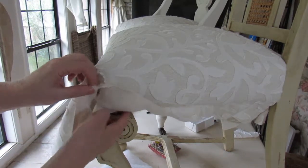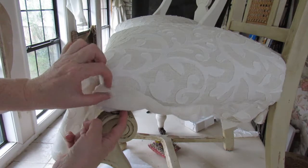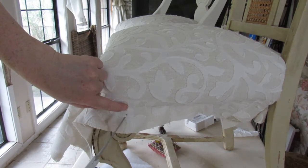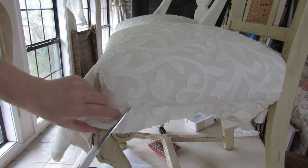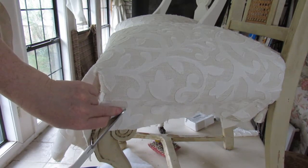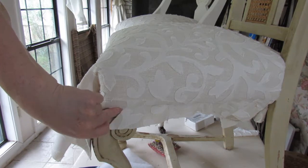Right, I'm going to be cutting here, so wherever the chair leg is, whether it's a square one or a round one, I'm going to be cutting towards here, and that's where the corner is. And I'm going to cut in at a 45-degree angle going the other way. And the reason is, cut it to within 1/4 of an inch of the turning.